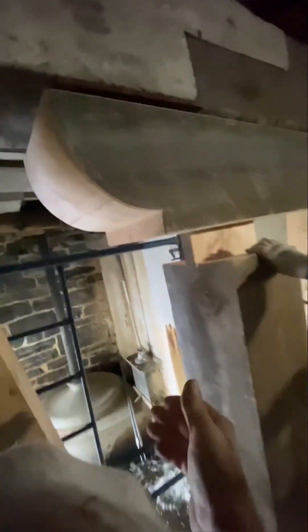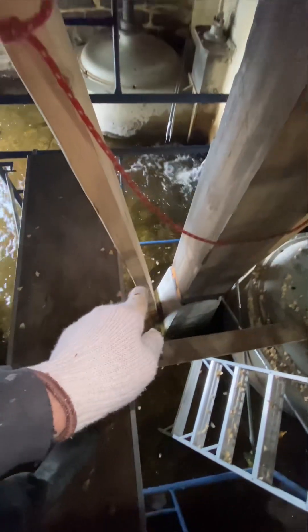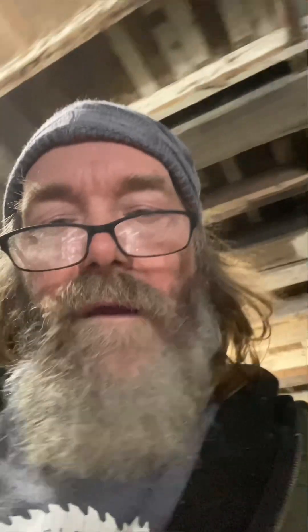Got a few things we got to clear. Now this moves up with our wedges — that's how it works. You can see that wedge, it's going to drive it up. We're fairly close; we've got to just take that up. We have to transfer now the load onto this beam and then remove these. Then we're going to put six-by-sixes against there and jack with 20-ton jacks right here, push this thing up, and drive in our wedges even further to transfer the load. It can be a little difficult to see what's going on without being up close, so I'll draw back.